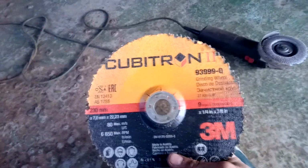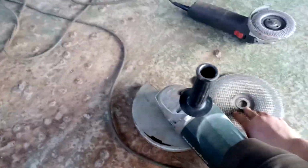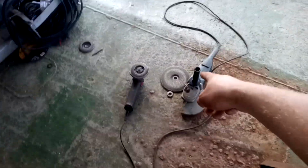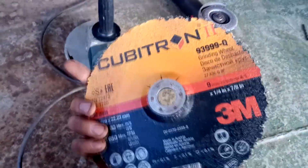So almost finished cleaning all the cutting edges, and the way I normally do that is that I use, I think it's called Cubitron Type 2 abrasive discs. They're really good for heavy duty work. When I was removing the old bulwarks, I had to grind down the old seam all the way around the boat and also the side, and I think in total I only used like 8 of them, and they are quite expensive. I can't get them in Denmark without having like a company CVR number thing, so actually I import them from the Netherlands. I take them in my hand luggage into the airplane, and I think they cost around 20 euros each. It's quite a lot, but they work really well.